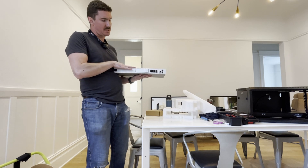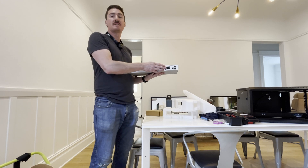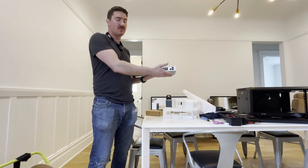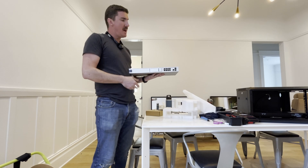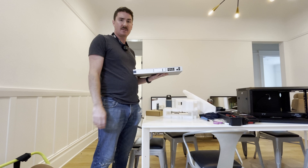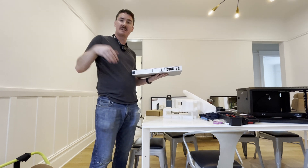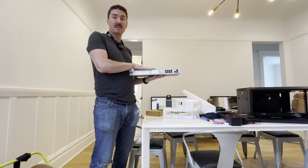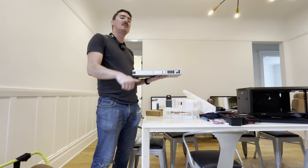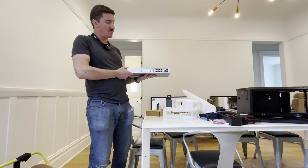This device works nicely because all these are PoE ports, so I can run and power all of those devices just through this — I don't need a separate PoE switch. What we're going to have in that rack is just a PDU, a little surge protector, the cable modem, and then this device. That's going to run everything, because this device will run both the network infrastructure and the Wi-Fi APs. It'll also run the security camera system through the application Unifi Protect, which works pretty well.